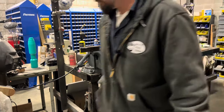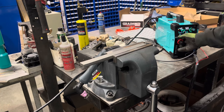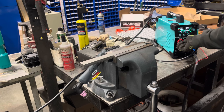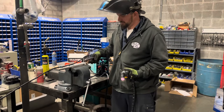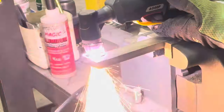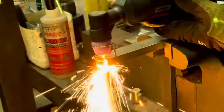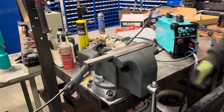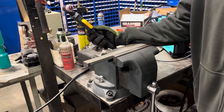Now let's throw something bigger in here. I found a piece of half-inch rectangle stock — which according to the book is roughly the machine's maximum, and I think that's absolutely awesome for what we're using here. We'll go ahead and crank this up to 50 amp full tilt and set our air to 55 psi. Hook up the ground clamp, make sure everything is as good as it can be. Dude — like it wasn't even there. I cannot tell you how cool this thing is. Please excuse the cleanness of my cut; it's early and I haven't had coffee yet. But this is absolutely awesome.